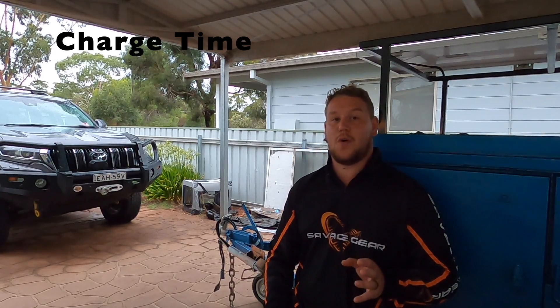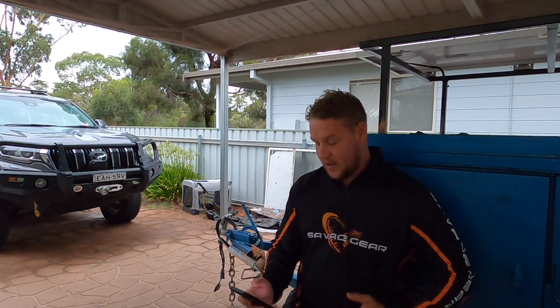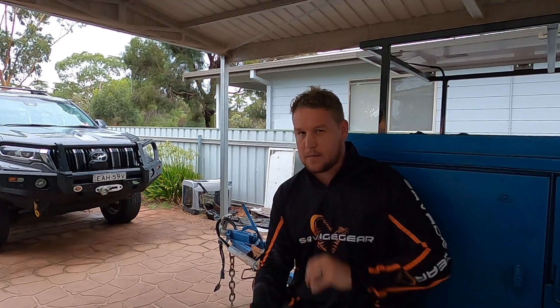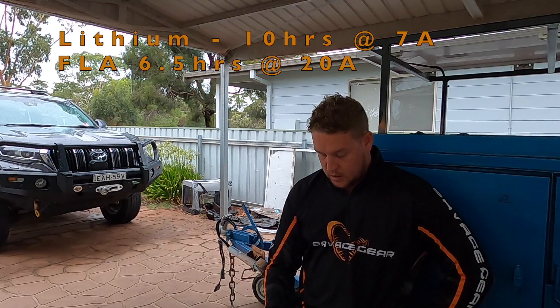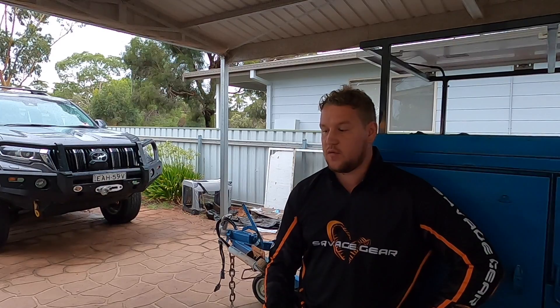For charge time - I didn't video this and I'm sorry about that, it would have just been a camera watching me read monitors. The lithium took about 10 good charging hours to get back to 100%, about a day and a half with that 110 watt panel pumping in around 7 amps for those 10 hours. Lithium has a really short bulk charge time and can accept a lot of current. Surprisingly, the lead acid battery actually won this category: six and a half hours of drive time with a 20 amp DC-DC charger.